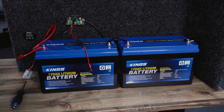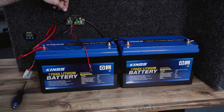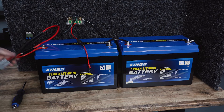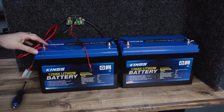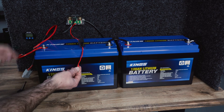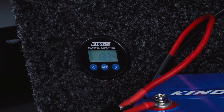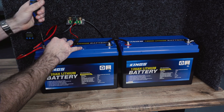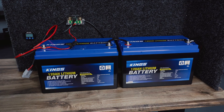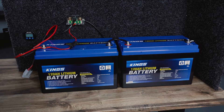For a series setup it's much the same. The negative wire and temp sensor come off one battery, go into the B negative side of the shunt, and that earth continues to the P negative side of the shunt going to all appliances, loads, and chargers. The batteries are wired in series and the positive output comes off the other battery. It's important to mount the positive wire to the second battery — if connected to only the first battery, the monitor reads as a 12 volt system, which won't be correct. Ensure it's installed on the correct battery so the system reads as a 24 volt system, and set your amp hour capacity to 120Ah.